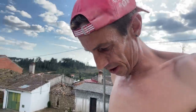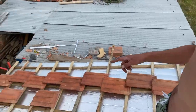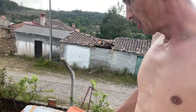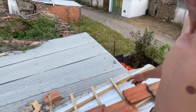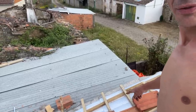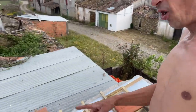Beautiful day to lay some tiles. And I'm still calculating. So I laid them all out now on the standard spacing, 34.5 centimeters. So at first, of course, I made the mistake again to make the template thingies 34.5. But yeah, they need to be 34.5 minus 4 from a batten. So this is the default spacing.